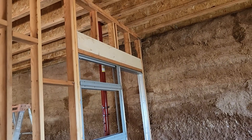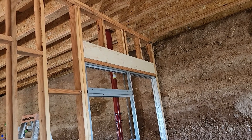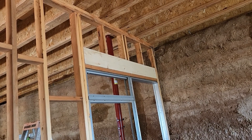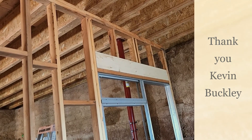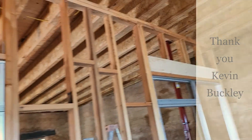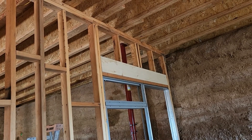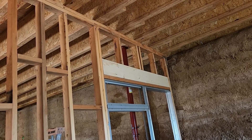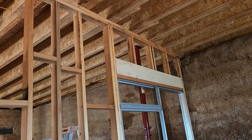Dawn put this header in. We've been talking about it and one of our viewers said you really need that. We had been discussing whether we needed it or not, and I'm really glad that viewer encouraged us to put these headers in. So he put this one in and he still has to put this one in. These are two-by-eights, double stacked — laminated, if you will — two-by-eights side by side to make a header over those two pocket door frames. Thank you to that viewer who encouraged us to do that.